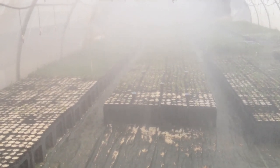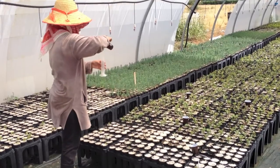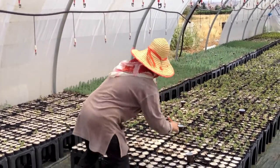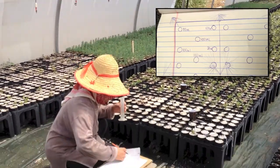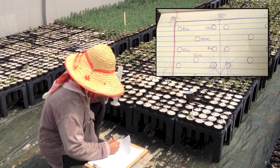When the irrigation system is off, use a graduated cylinder like the one you see here to measure the amount of water that has collected in each cup. Put that number next to the location of that cup on your schematic map. Continue measuring the water collected by all the cups. Each cup will be an individual point of measure.